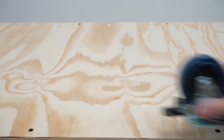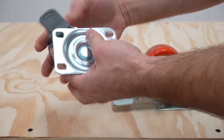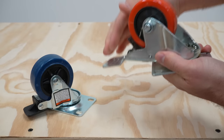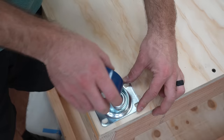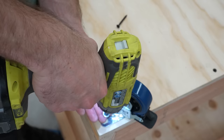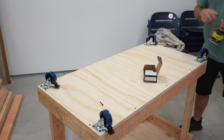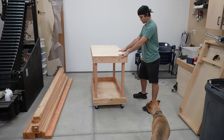The last step is to add casters. There are a few different options based on what you need. I bought economical locking casters from Harbor Freight — the wheels lock so it can't roll away. More advanced casters also prevent rotation when locked, really preventing it from moving at all. Choose casters depending on your needs, and remember you can always change it later. I used the same shorter screws to attach the casters. The holes are bigger than the screw heads, so I used small washers to make it work. I connected the casters about a half inch away from the edges. And just like that, one workbench is done — it's really sturdy, has a lot of surface area, and there's built-in storage underneath.